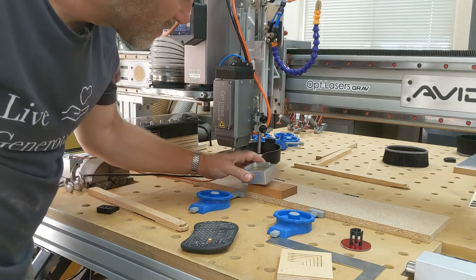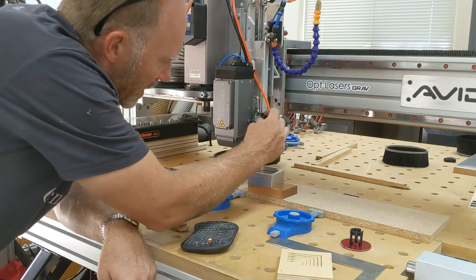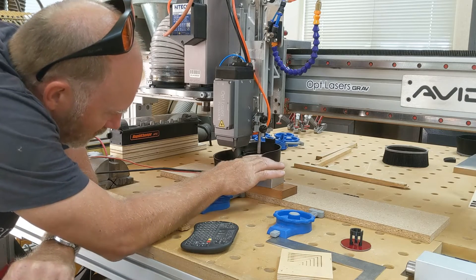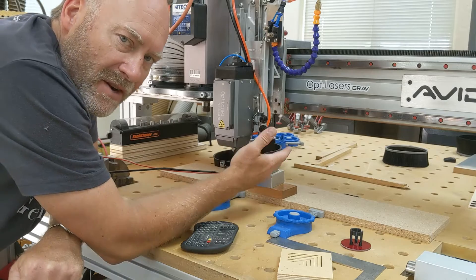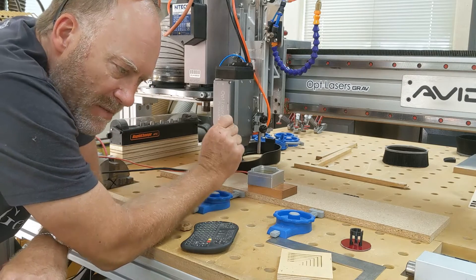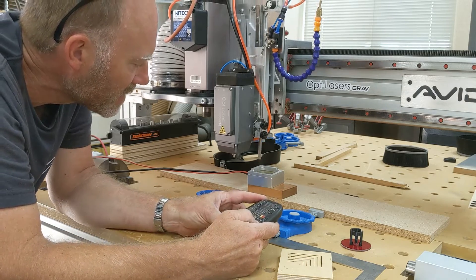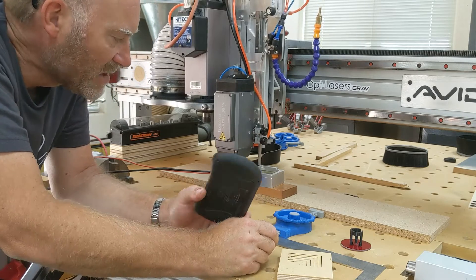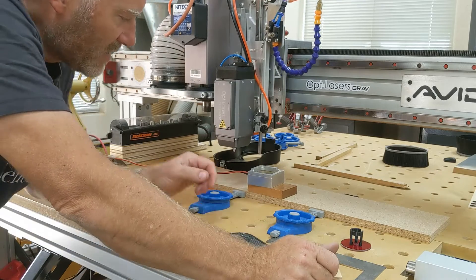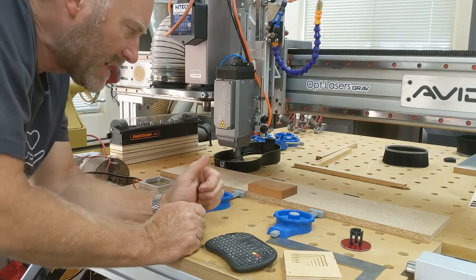So typically what I do is just set my Z with this. I have this little stop collar set such that when it's down and I lock this, it's basically going to touch down and give me Z zero right at the optimum focus point. I've characterized this laser and you can see it's pretty level — it leaves about a quarter-inch gap, and that is my best focal point. Based on that, I can just use the standard touch plate routine that comes with the Avid machine and do a Z touch off with that rod. So now my Z is set perfectly, which is very important with lasers because you need to have that set to get a good focus point.